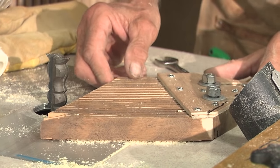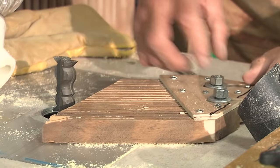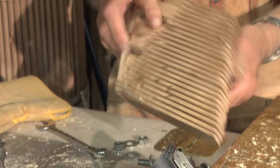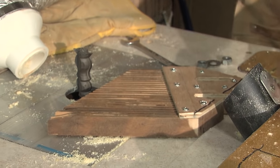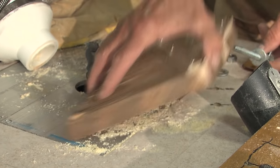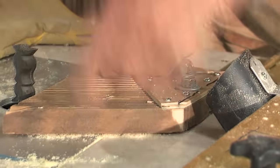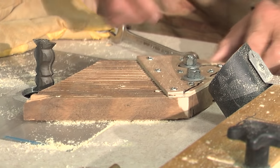Now these feather boards — I want to show you something. Trying to clamp them down, they just keep moving from vibration. The best way I've found is to put bolts through and bolt them on real tight. You can buy plastic ones, but this one I've had for many years. I had to make it short because of the other router head. The big advantage of a homemade router table like this is that you're not afraid to drill a hole wherever you need one. With a fancy store-bought table you don't want to drill in it.